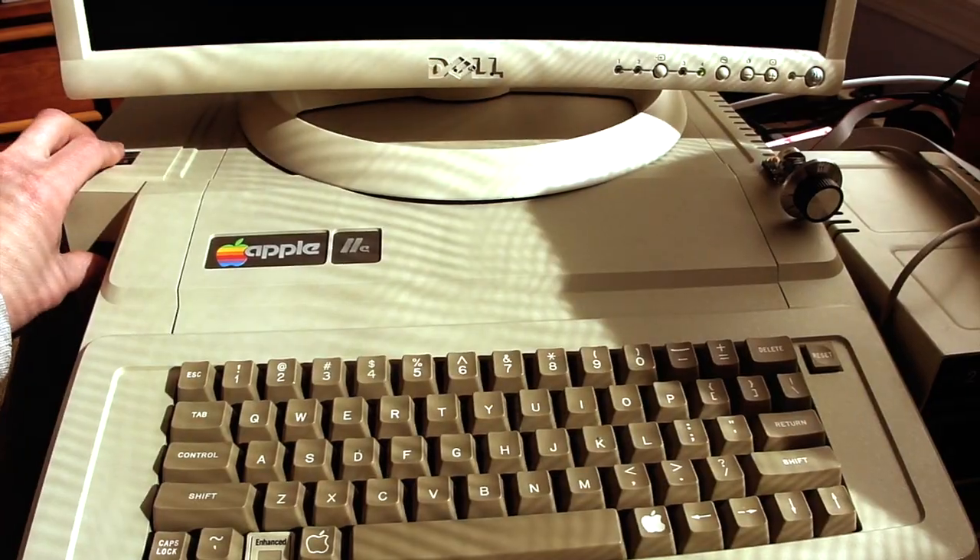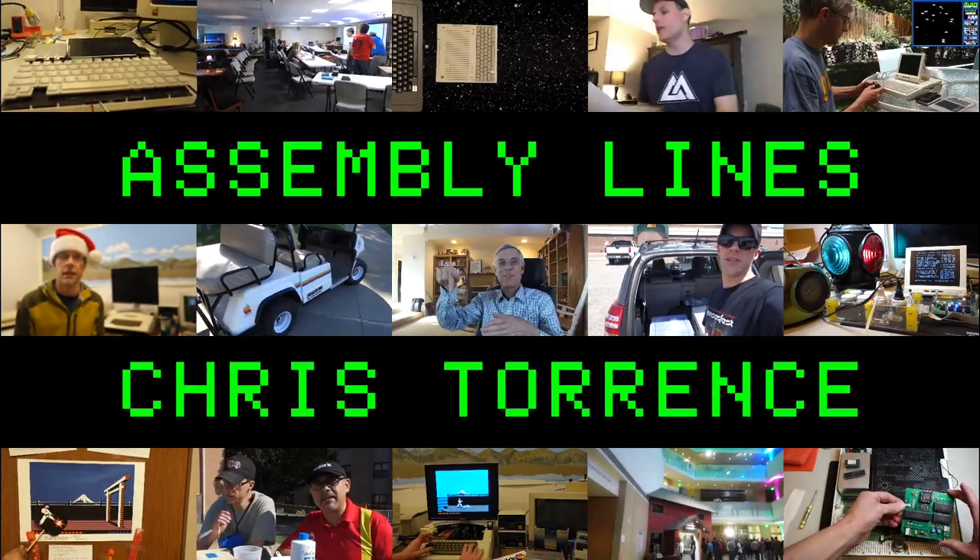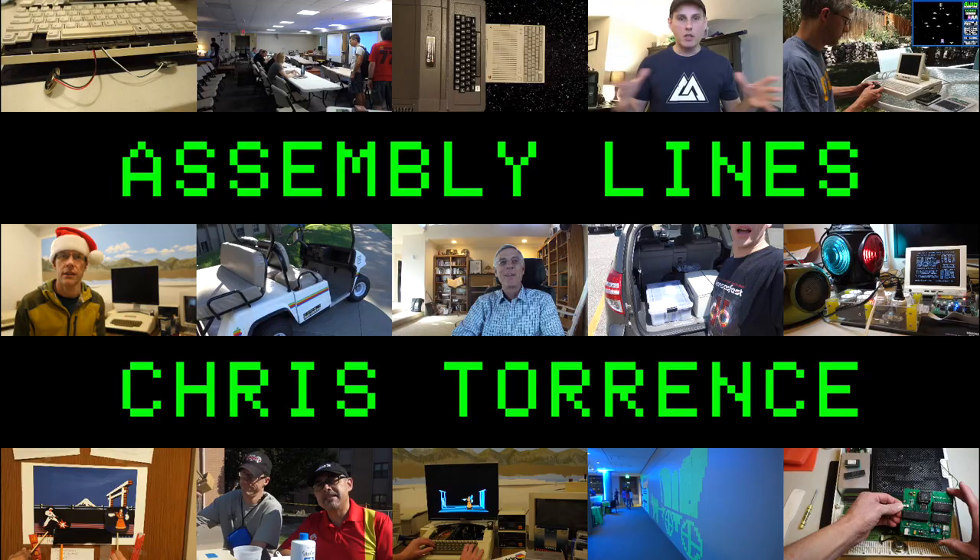So what are the symptoms? When we turn it on, you'll get a screen full of trash and repeated beeping. Normally when you hit the power it beeps once and then goes to the boot-up sequence, but this one beeps over and over unless you hold the reset key down, and then it gets quiet. When you let go, it starts again. We'll show you.